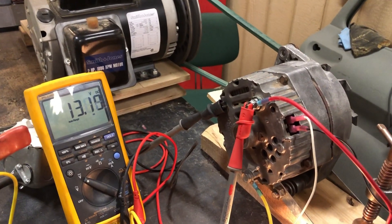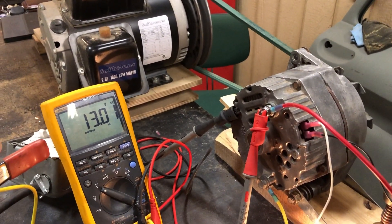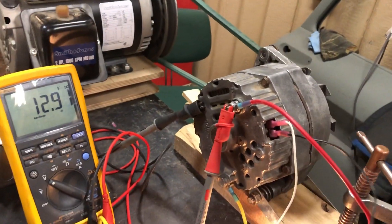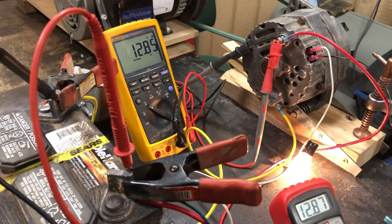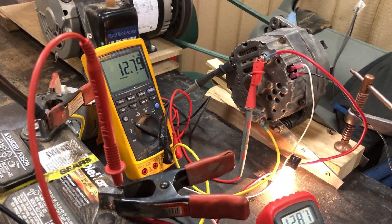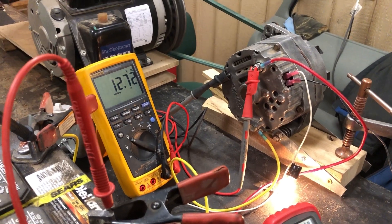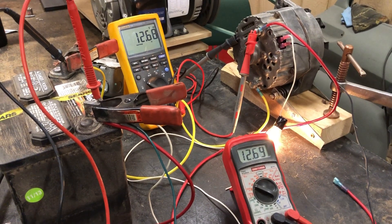If you're using one of these alternators as a retrofit on an old tractor — converting it to 12 volt or updating from a generator — tractors don't have a very high electrical load, so you're perfectly fine jumping terminal number two directly to your alternator output post. However, if you're running it on a car or vehicle with a higher electrical load — headlights, radio, and other things — you should put your remote sense wire at the main junction block where everything comes off, so it will compensate for voltage drop due to high amp draw or internal resistance in the wiring.